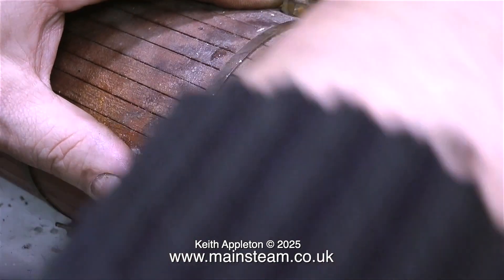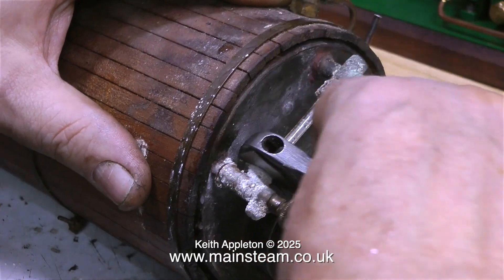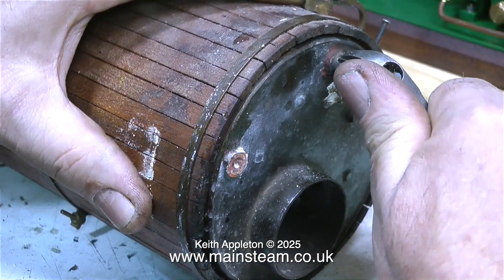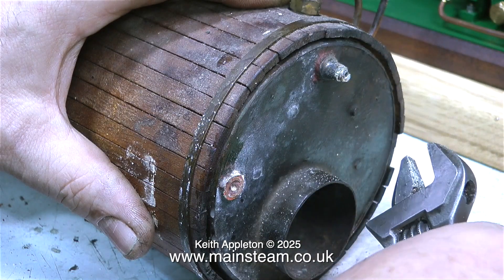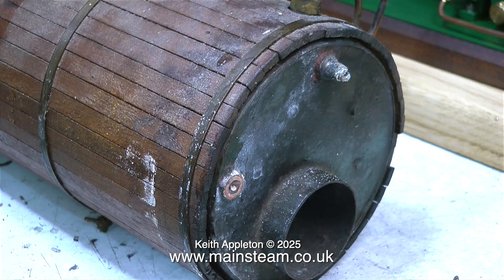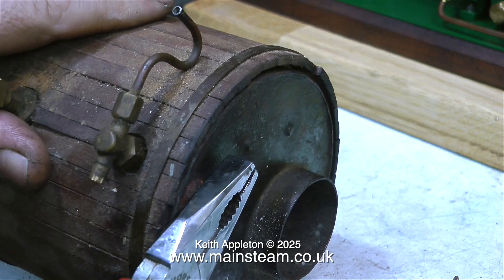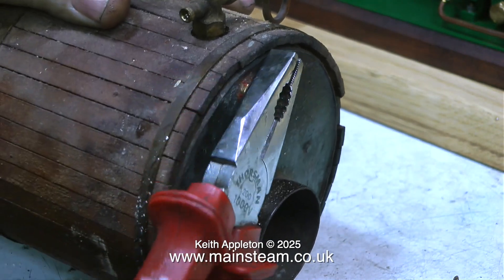The first thing to do is to see whether I can resurrect the water gauge — it's very unlikely. This is what is known as dezincification. I put hardly any pressure on the fitting at all but it just snapped off, and the top one's the same although it's broken off in a different place — the brass has got really brittle. The best material for fittings has always been phosphor bronze, but most of the time they're brass. To be fair, they last about 50 years, so really what's the point in making them expensive out of phosphor bronze when brass does the job for quite a long time.